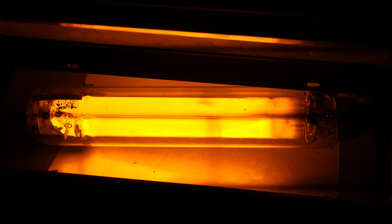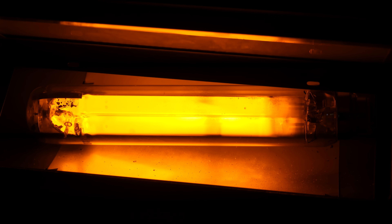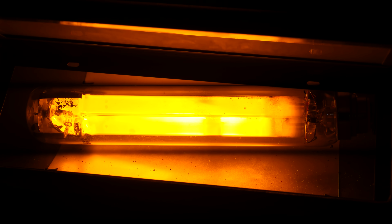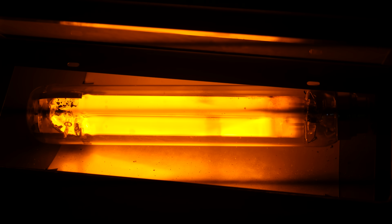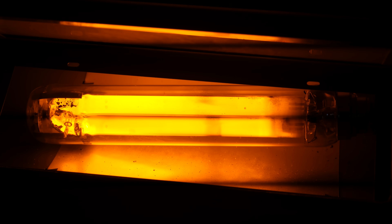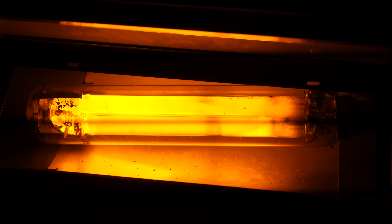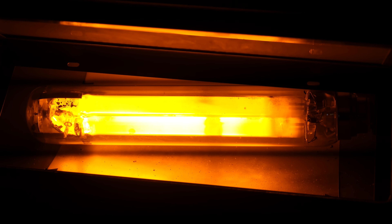Yeah, that's as bright as it's gonna go. I do want to show that one of the nice benefits of this type of lamp is it has a very slow warm-up time. With every increase in power output, the bulb gets longer — only the 180-watt bulbs had that 200 lumen per watt efficiency, but those things were enormous, basically like four-foot fluorescent tubes in a huge bulb. The fixtures which hold them look silly because they're just these very long things. I've never seen one of those warm up and I wonder if it takes longer because the bulb itself is longer.